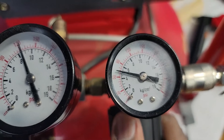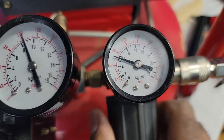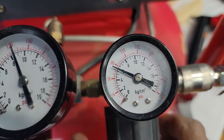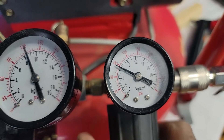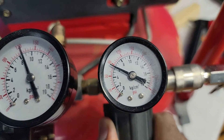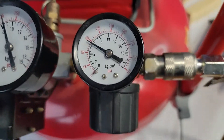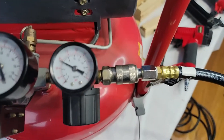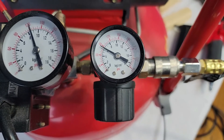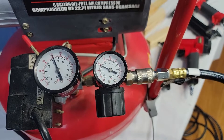And as you can see it's going up. This is how much pressure I want going into the gun. It says minimum 60. I think basically put it somewhere around 90 and you're good. Turn that to the right and it goes up. We could probably get away with a little under 90. But the maximum for this particular gun is 100 pounds per square inch. So we have that all set. Now the pressure in the hose is ready.